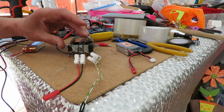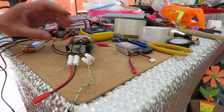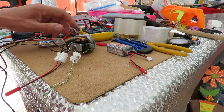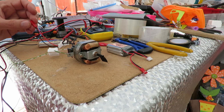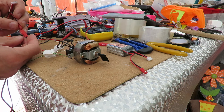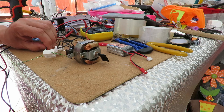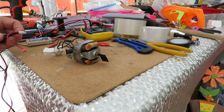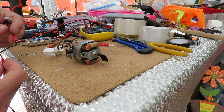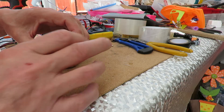So we've rigged it up now — the two field coils are in parallel, and I can actually run this with my LiPo batteries, although only just. If I power the field coils with say 7.5V, we've still got a fairly high resistance, so this doesn't get hot — we're not burning the wires or anything like that. And then if I put this 3S, so 11.1V, probably about 12V, on there — it doesn't jump into life because we still need to give it a bit of a kick start.